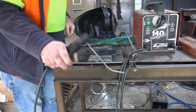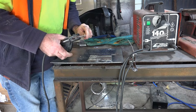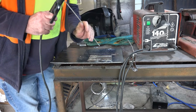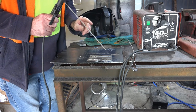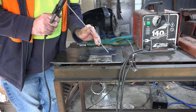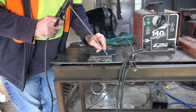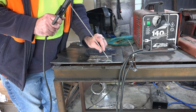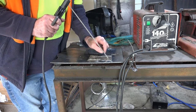Another trick I also learned — if you've got your electrode in the holder, put it in whichever way feels most comfortable for you, and either bend it, or if you don't feel comfortable bending it, hold it halfway down while you start your weld when you're trying to initiate your arc. Because you've got a real long distance between your hand and the tip, and if you're not used to it, you flop around. The end of the electrode is shaking and it's really, really hard to start an arc.